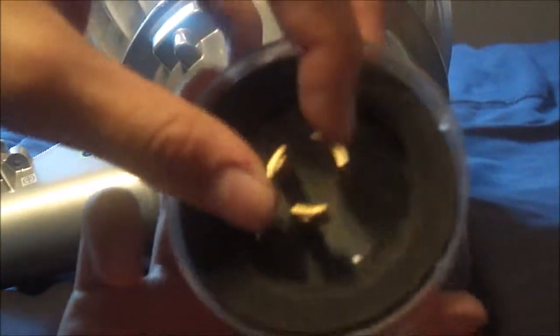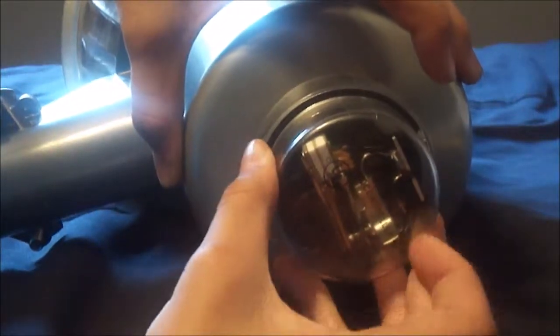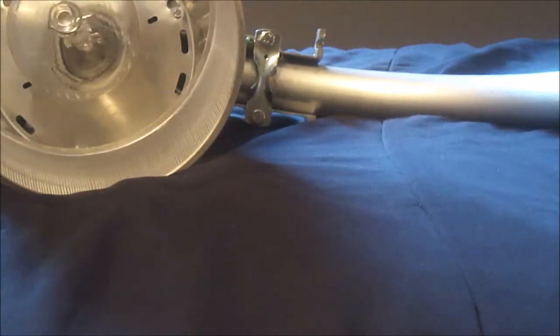The next thing you want to do is not install the light bulb yet. You want to flip it over so you can see the photocell socket. To install the photocell, locate the large prong and insert it into the large hole. Then turn it — there's an arrow that says 'install' and you just turn it until it locks in. Lastly, install your light bulb by screwing it in, and now your light should work. As you can see, we did it all right so the light bulb turns on. I hope this helped you — that's the basic parts of your regular NEMA head area light and how to basically assemble the light fixture. I hope you enjoyed, and as always, thanks for watching.